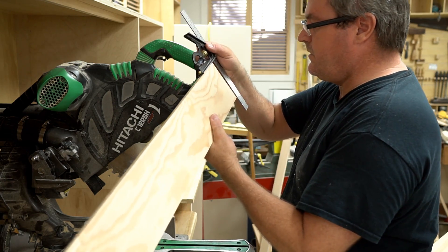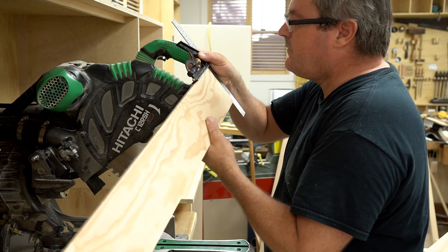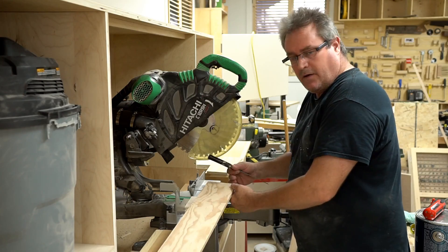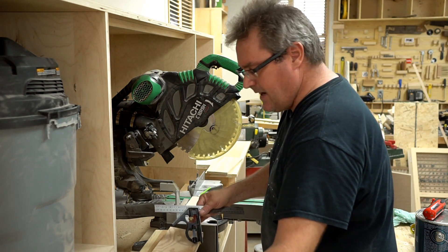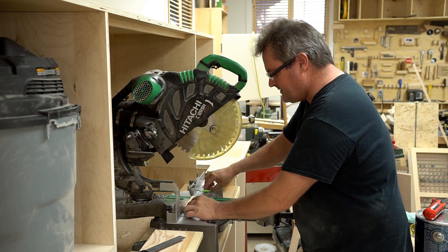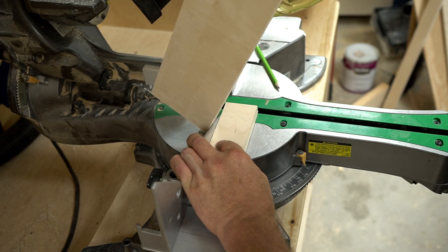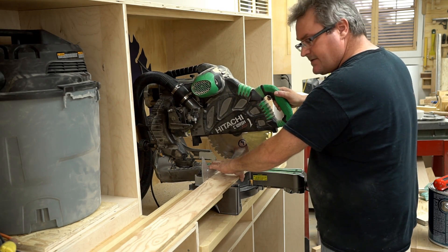Now I'm going to take that and have a look at it with my square to see exactly how square the cut is. We're trying to get it close here, not exactly perfect just yet, but this is looking very good — it's a little bit open on this end but not very much. With the cut open on the front, the fence has to come further out. I'm going to make that adjustment by tapping it with a piece of wood, but first I want to make a mark. I've got a block of wood up tight against the fence and I'll make a mark on the bed of the saw to indicate where the fence is right now — that way I can move it out just a small amount to cover that pencil mark. Now I'll make another cut off the edge and try it again.